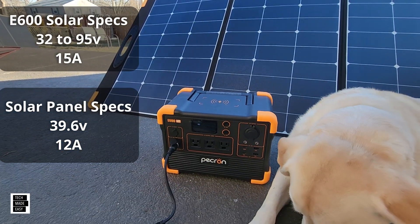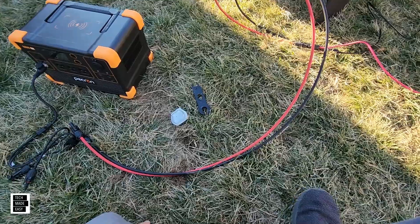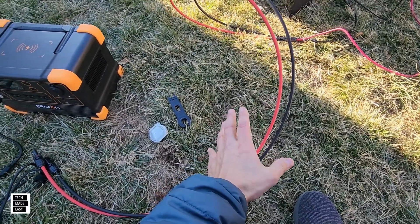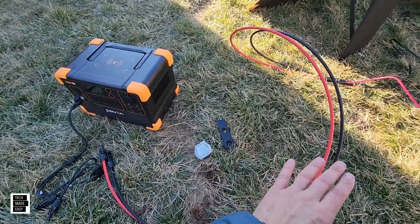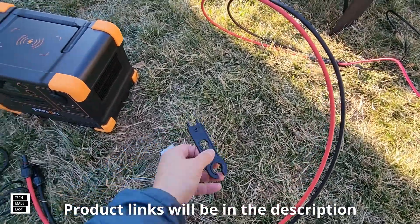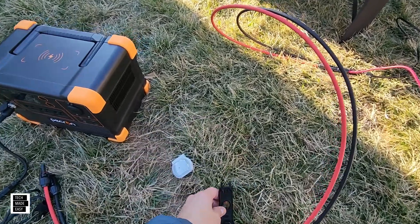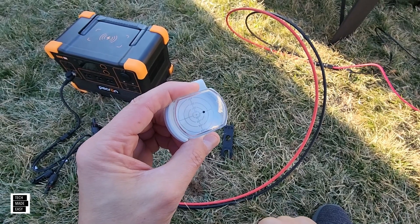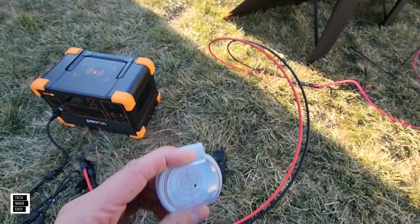Before the solar test, a couple of things to consider. You may want extra solar cable — 10, 20, or 30 feet. This is 10 gauge, which is a good thickness; the lower the number, the thicker the gauge, and 10 gauge is way more than enough for a power station like this. We also have a solar disconnector tool we'll show you shortly — very inexpensive. And there's this solar angle guide with a dot in front that creates a shadow — you want that shadow centered for best panel alignment.